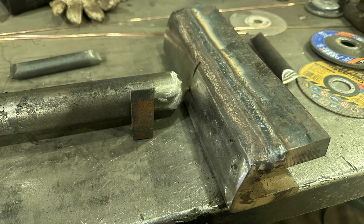To start things off I found a piece of angle iron that was three-quarters inch thick and a piece of one-inch thick bar stock laying around as scrap. I did this partially because it was scrap and I didn't see the necessity in ordering all new steel to make something they'd probably still break anyway. I ended up doing a full penetration weld on that one-inch bar stock to the three-quarter inch angle iron — 100% stick welded all the way through to the surface, essentially making a fully welded U-channel.